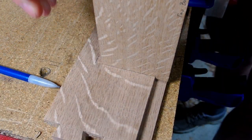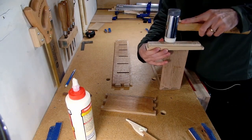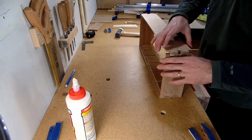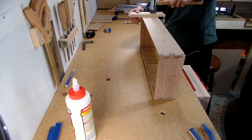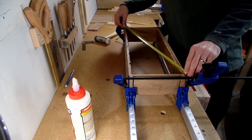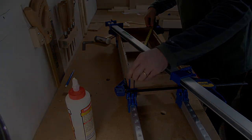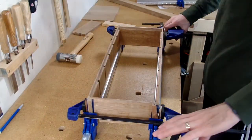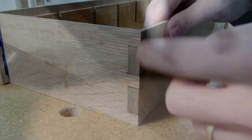Before cutting the notches on the shelves, I needed to glue together the cabinet first so I could get the shelves to their exact widths based off the true width of the glued-up cabinet. After finishing all eight stopped dados and the inside of the cabinet, I glued everything up. The biggest concern was making sure it was square, which I accomplished by checking that the diagonals measured the same both ways. After letting the glue dry I took off the clamps and cleaned up the dovetails on all four corners — overall not all perfect, but I was very pleased with how a majority came together.